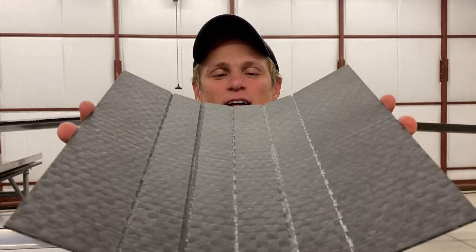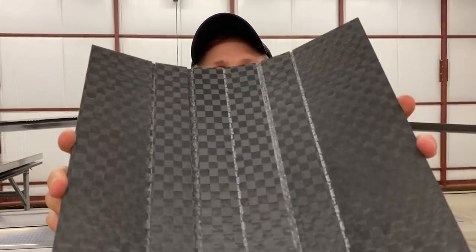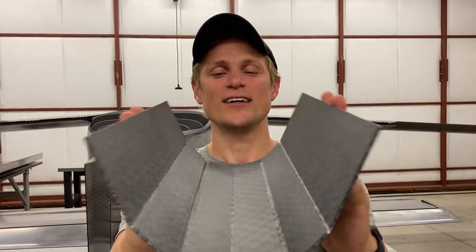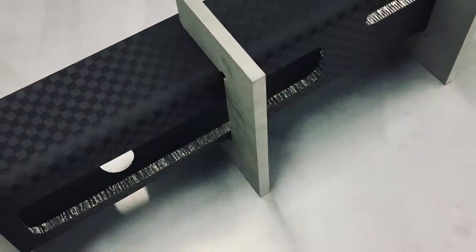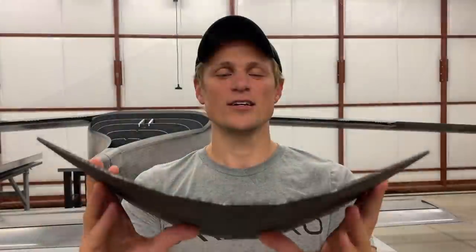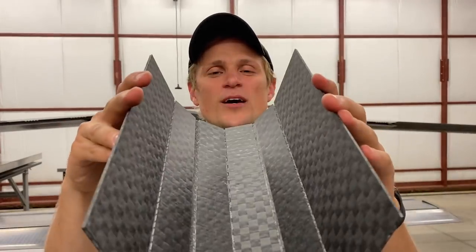One other advantage related to the design flexibility is folding panels. This is a cool little trick where you cut a slot in one of the skins of the carbon fiber structure. With that technique we're able to fold up and create different shapes that aren't just flat panels. We use this technique in the armrests of the Dark Arrow 1 as well as the wheel wells and baggage compartments. Cool little trick that you can do with panels.